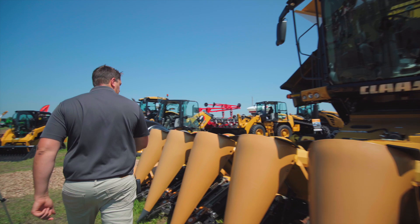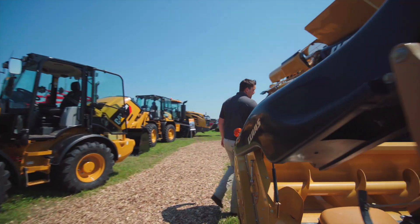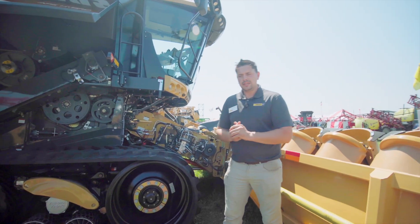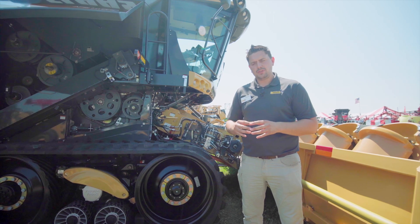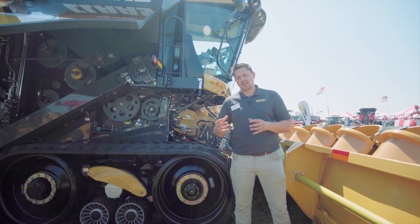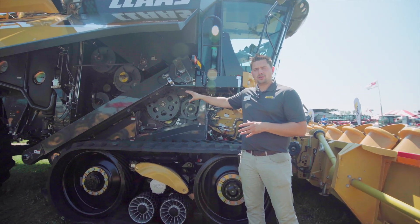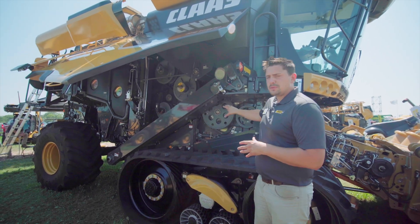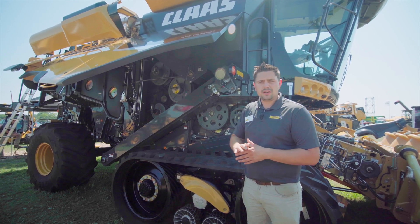If you want to follow me this way we're going to start up on the combine. The combine we have today is the Lexion 740 — it's the Class 7 machine. It is the APS hybrid unit, combining two systems together to make a unique threshing and separation system that's the only one of its kind on the market. At the front we have the APS threshing where 100% of the threshing is done, and at the rear is the separation — 70% of your crop is out of the crop mat which is threshed here, with the final 30% done at the rear.